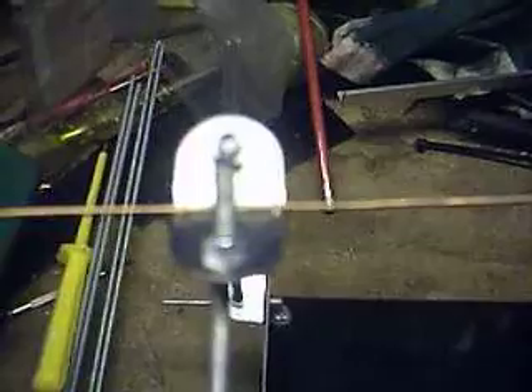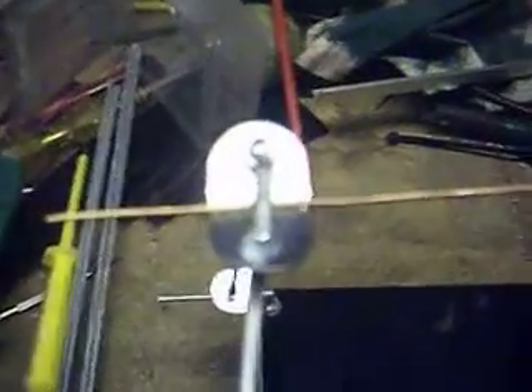All I've done is taken some copper wire, drilled some very small holes in it, and just wrapped the wire around over the top just to keep the shaft down. It generates a lot of friction, but what'll happen is, as it wears, the friction should reduce.